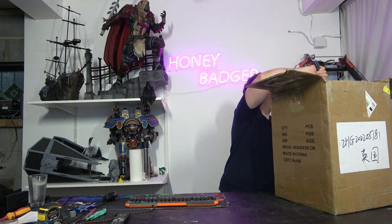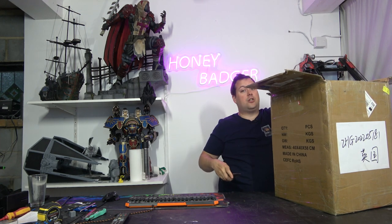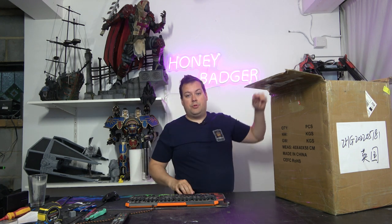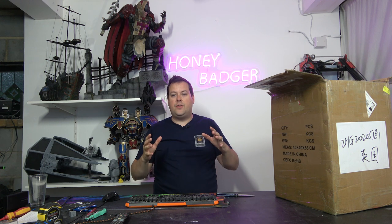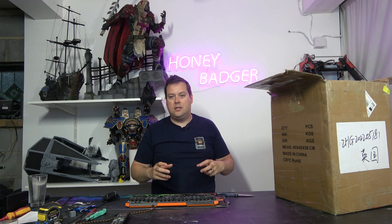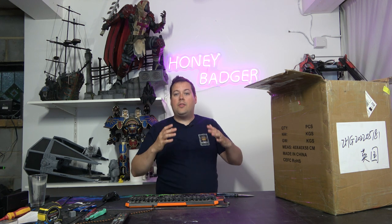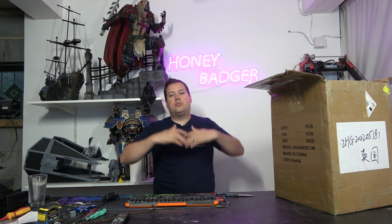It's not something that we've really seen on a lot of machines — in fact I can't think of many that actually have a heated vat. For those who aren't aware, when you are resin printing you want your resin to be at a consistent temperature. Changes in temperature change the viscosity of the resin, which is why if you put your 3D printers in an uninsulated shed or garage, the print settings will need to be different than if you had them in your home.